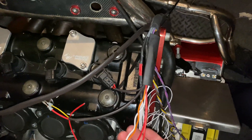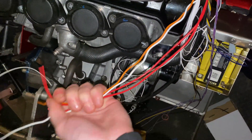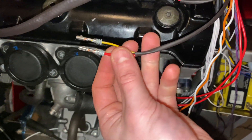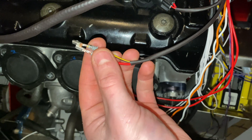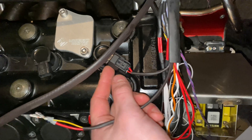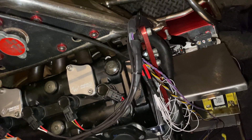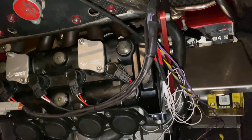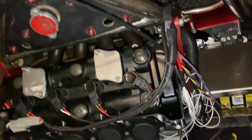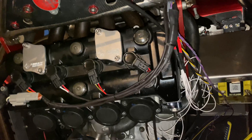I've stopped here just so you can see the stages in which these coils get wired up. Here we've got just the exposed wires themselves, yet to be paired with the live feed. Then the next stage is them being crimped and terminated correctly, and then there they are being inserted into the connector and connected to the coil. So here we have the finished product for wiring in one of the coils — all nice and appropriately strain relieved, nothing is crossed over one another.